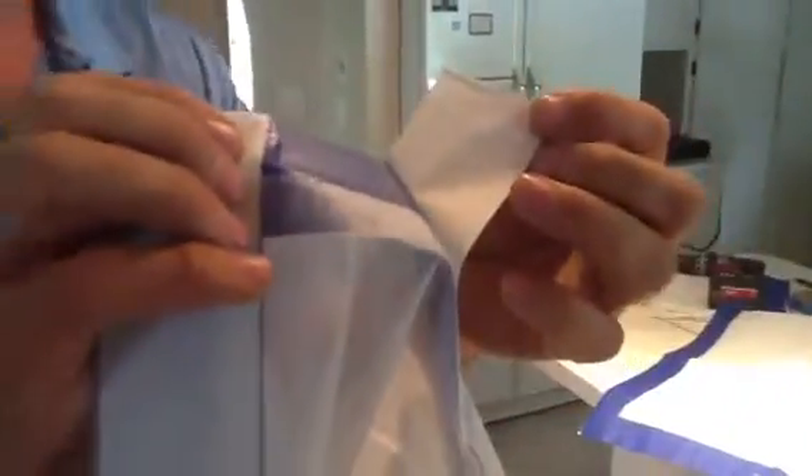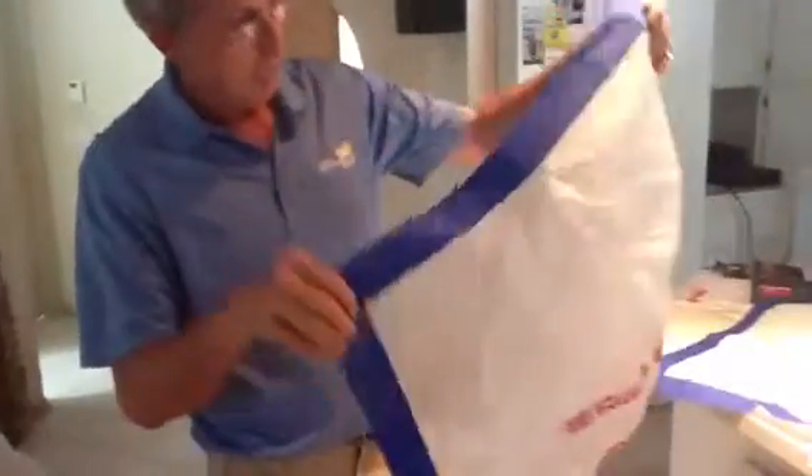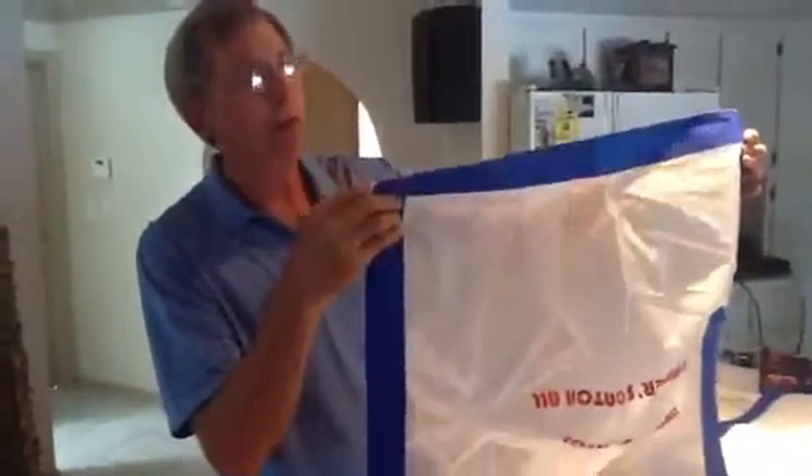You want to use this kind of stuff when you're doing duct work replacements, taking out complete systems. It's also useful when you're doing new duct openings — it catches lint, dirt, and attic insulation. It's good for when you're doing blower assemblies and turning on your AC system, to catch all the little microfibers that might come out.